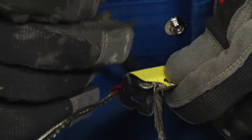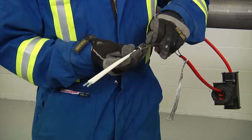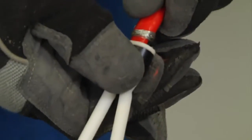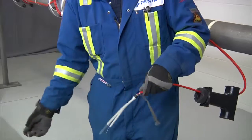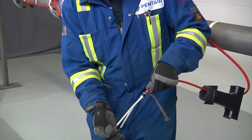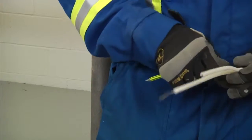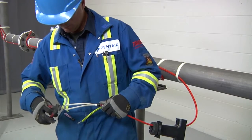Mark about 5/8 of an inch (16 millimeters) on the inner jacket. Retwist and straighten the wires. Insert into the core sealer guide tubes. Push the core sealer onto the heating cable to the mark made previously and remove the guide tubes. Slip the green-yellow tube onto the braid. Trim bus wires and braid, leaving about one half inch (13 millimeters).